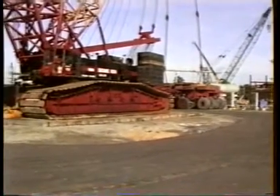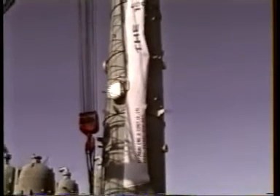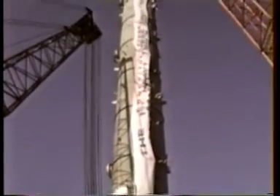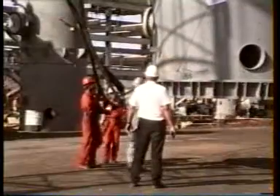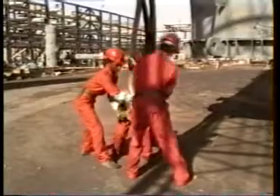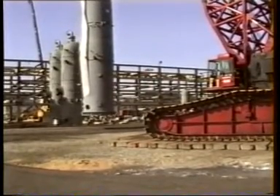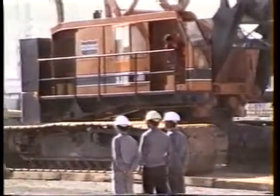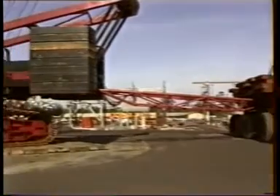The first column was a unit of only 100 tons, which was lifted into the vertical position and then slewed towards the foundation at a radius of 42 meters. The crane was placed on a base of crane mats with four hydraulically activated outriggers in between the crawler tracks to absorb approximately 30% of the total crane load. The superlift counterweight was placed on a special bogie connected to the back of the crane and hydraulically propelled to follow the slewing of the upper car body.